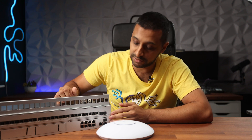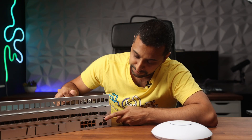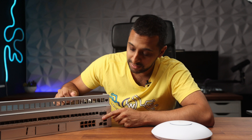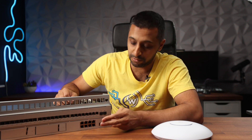At the bottom we have the main gateway, which is the device that does all the routing, security, and everything else. On the front we have two 10 gig SFP+ ports, a WAN port — these are all remappable so you can change them to whatever you want, LAN or WAN — and you can have up to two WAN connections. We also have eight gigabit ports on the front, and two hard drive bays inside.